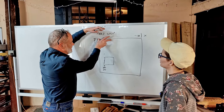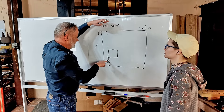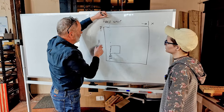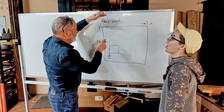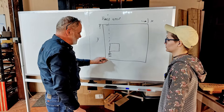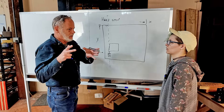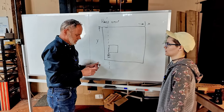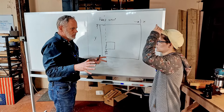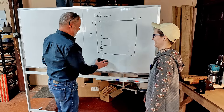Now when you say go back to Y zero — down to here — the machine is going to try to move 50 inches from where it thinks it is, but it's actually here, and it'll move down, down, down and hit the hard stop again. There's nothing to tell the computer that we're at our limit. Without limit switches it's a completely open world — we could drive the machine wherever it thinks it can go.